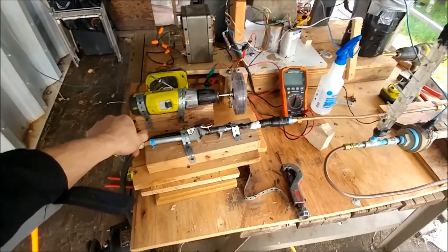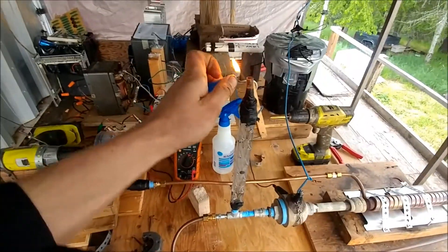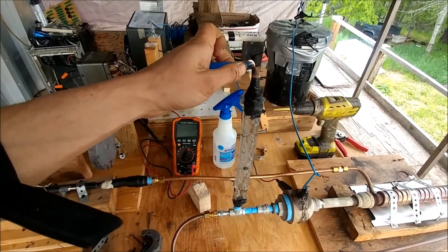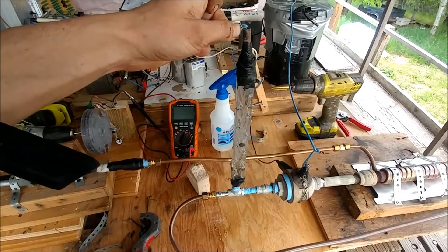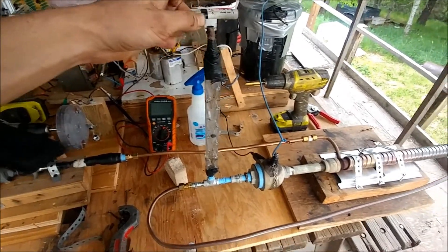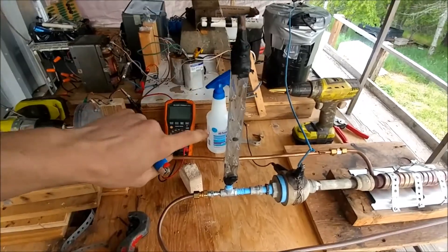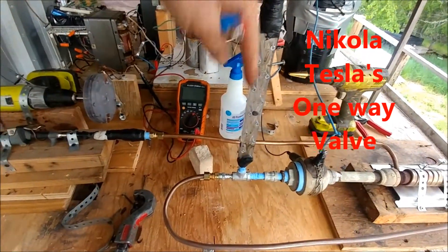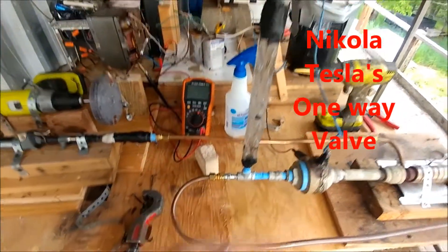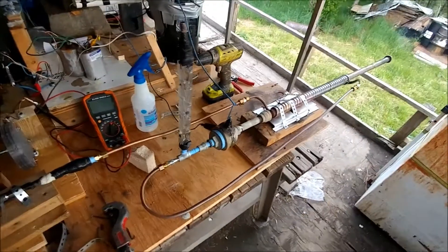To show something interesting here: when you turn on the air, it creates a vacuum right there, and that sucks in extra air for the combustion chamber, because the combustion chamber needs a lot of air. And this valve blocks the back-explosions but still allows air to be drawn in when there's no pressure inside the pulse jet. And we're looking at it.